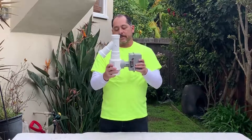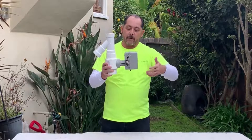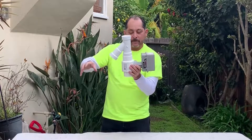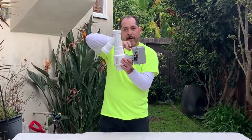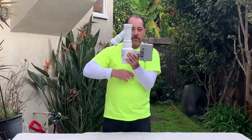It's a very unique system in the fact that when the power goes out, it's what's called always open. So even if I have it going to the grey water system and the power goes out, the unit has a small little battery that rotates the valve and opens it so that the water will continually go into the sewer system.